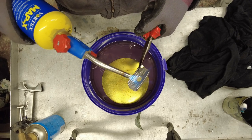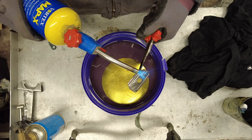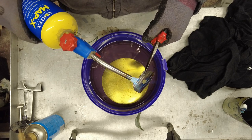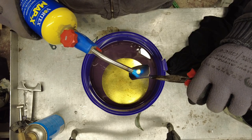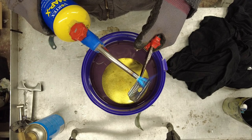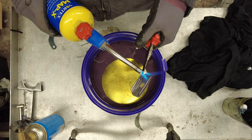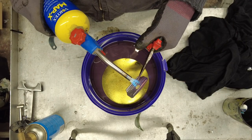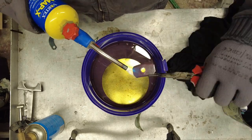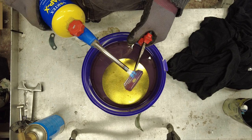We want to be heating our item to about 400 degrees or so — basically until it starts to glow. If you go crazy hot, you'll find that the coating will just kind of flake off. And if it's not hot enough, you'll just have a blue coating rather than a dark blue or black coating. It takes longer than you expect generally, so be patient. Alright, it's starting to glow a little bit — I'm going to quench it in the oil. A nice even glow there.